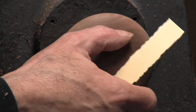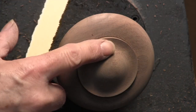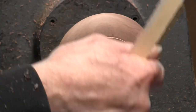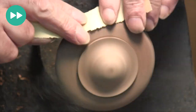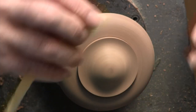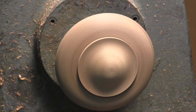We finished with 100 grit. I'm checking to be sure that there's no evidence of any tear-out from the chisel and that the only scratches I see are from the 100-grit paper and nothing left from the tooling itself. Now we'll use the 150 paper. We're going to reverse direction because you always reverse direction after each grit. For the finishing touch, reverse direction again and just give it one last touch up.